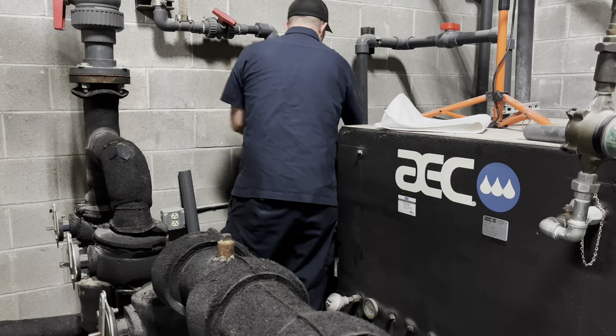In case you guys are worried about air quality — it looks worse than it is. There's a giant exhaust fan in the ceiling to get this crud out of here. This is just a necessary evil — these machines are expensive and if we don't keep them clean and cool, there's nothing but problems. Behind the small air compressor I have wired up an alarm that goes outside — just like the tower alarm — to let me know if there's something wrong with the air circuit. If we drop below a certain psi, it turns on a light and buzzer outside. It's controlled by a pressure regulator on the bulk tank — an electric switch that activates if pressure drops below 90 psi.